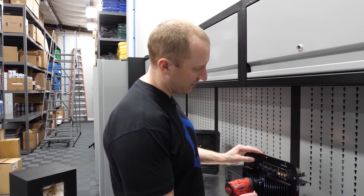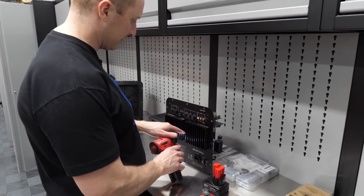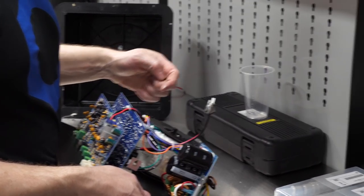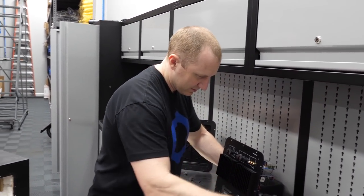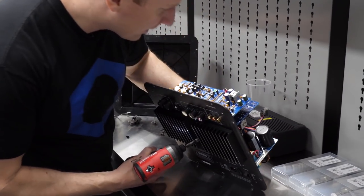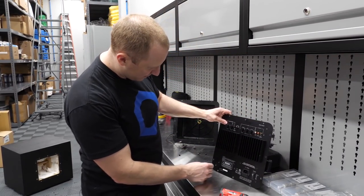All right, I'm still on day four, so that's the good news. Bad news is, notice the amplifier is taken apart on the bench. I was ready to start smashing stuff. I got my box kind of jacked up now, but this Molex connection here, the input board was not connected, hence me not having any input. I knew it wasn't an idiot. First I wired it wrong, and then I checked the wiring about six times more. But I wasn't sure which one of these needed to come out, so I ended up taking apart too much. Already gotten shocked once. The capacitors still have some serious juice. So now I gotta put all these screws back in that I took out and shouldn't have.